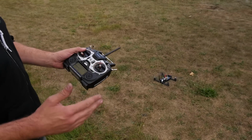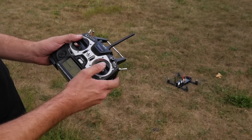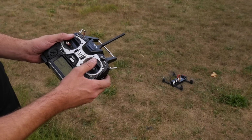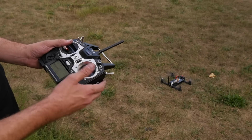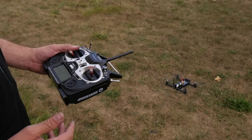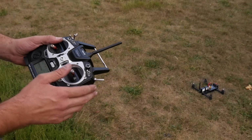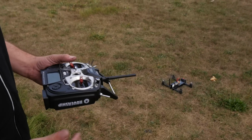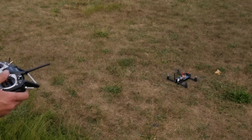One thing I like to do before I take off, just bump the controls. You can see it wanting to do a right bank tendency, left bank tendency, forward, and y'all, you can't really tell, but if that's looking good, you're good to go. If you did this and the gyro was backwards, they would immediately somersault. That's why it's really important to step back. Everything sets out good. Let's go ahead and hover it.